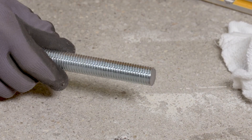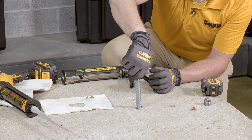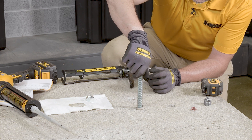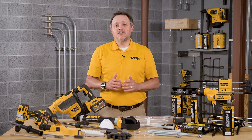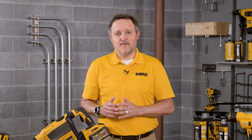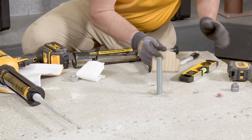The anchor should be free of dirt, grease, oil, water, or any other foreign material. Push the clean threaded rod into the anchor hole while turning slightly to ensure positive distribution of the adhesive until the embedment depth is reached. Observe the working — sometimes referred to as gel — time. Ensure that the anchor element is installed to the specific embedment depth. Adhesive must completely fill the annular gap at the concrete surface. After installing the anchor element, remove the excess adhesive and protect the anchor element threads from fouling with adhesive.